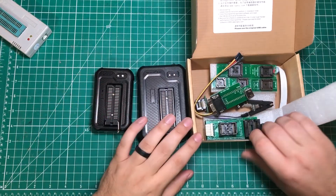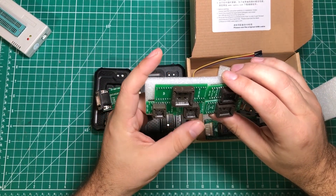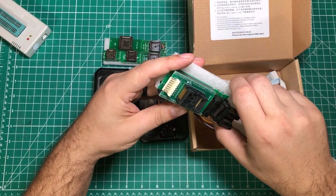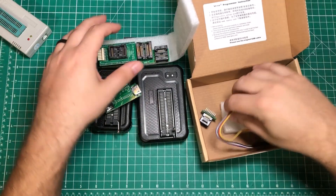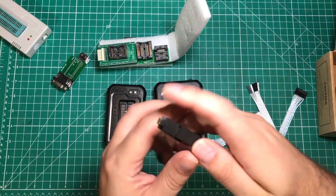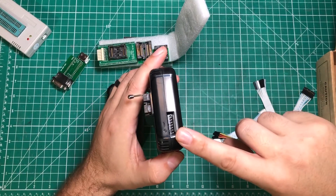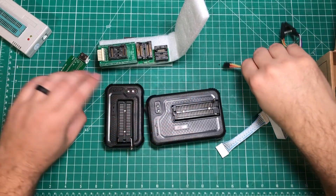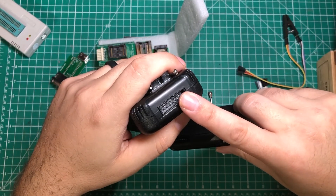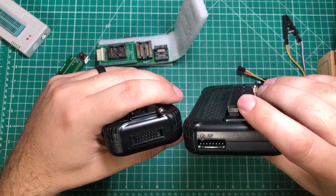The T56 has a different set of adapters — similar PLCC things, 20-pin, 40-pin, and a fancy adapter for TSOPs. These newer units can also do in-circuit programming. There's a little chip clip with leads that you can attach to program chips while they're still in the board. I noticed the adapter connector has 16 pins here — as best I can tell they don't do anything functionally different, though the adapters are intentionally different between models so you can't accidentally mix them.